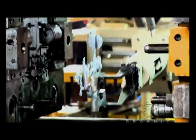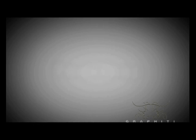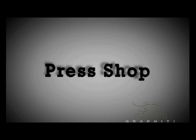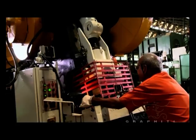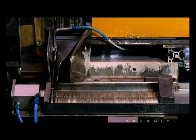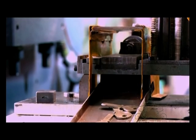These knobs are now further processed in the surface finish department. Our next step is manufacturing the keys in the press shop. On these 40-ton presses, keys are blanked from nickel silver strips. They are then shaved, tip milled and etched — finished in an in-house process innovation.